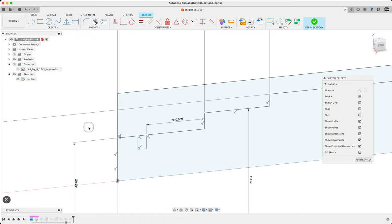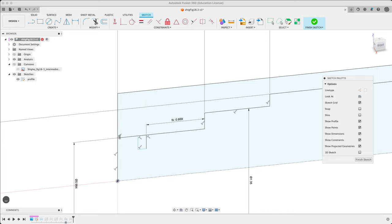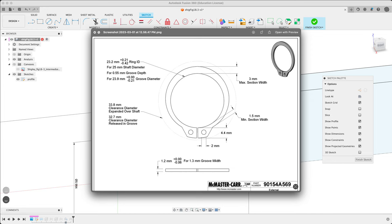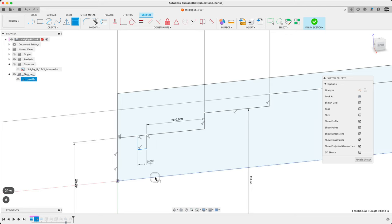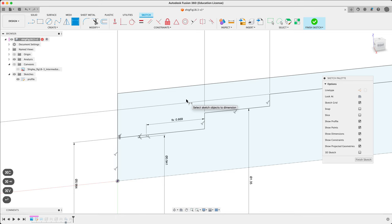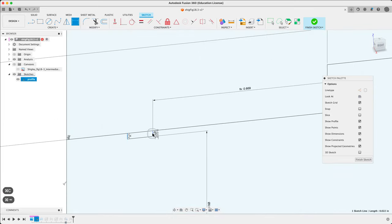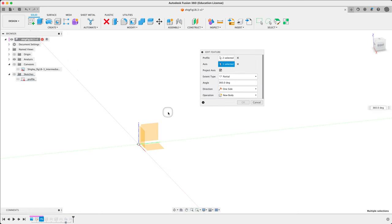Let's now have a look at our requirements here — I've got a screenshot. That's our 25 millimeters. So looking at the canvas: our groove diameter is 23.9 millimeters, 1.3 wide. So checking in 23.9 and the width 1.3. We also have to fix that revolve, so let's get in there. You might have to hold Control to turn off the preview. The issue was that the sketch was hidden.